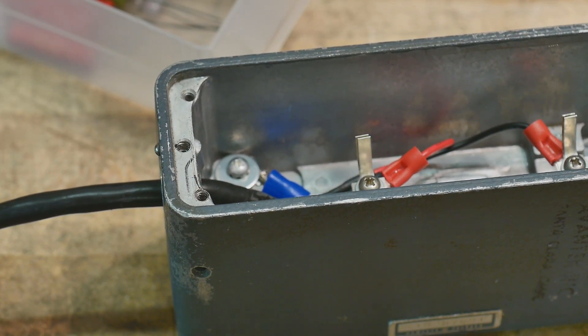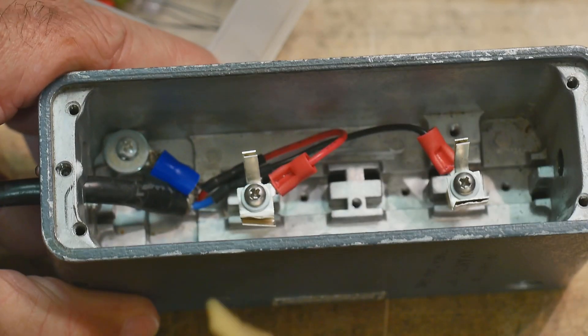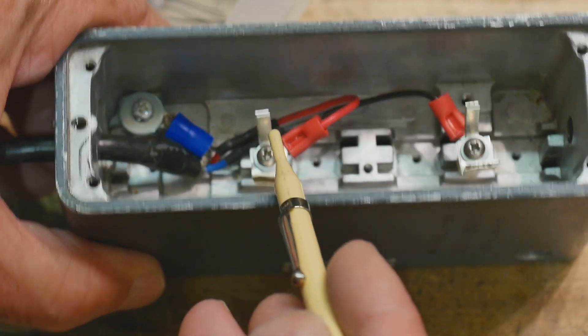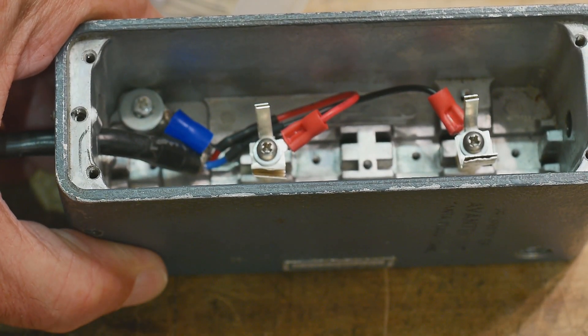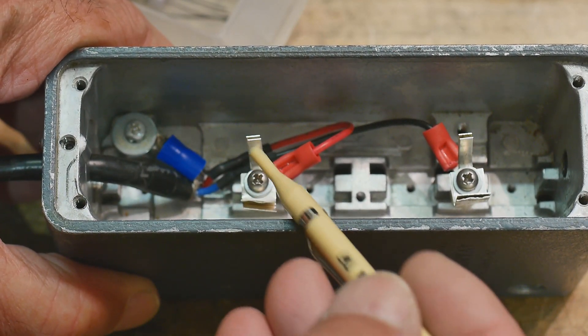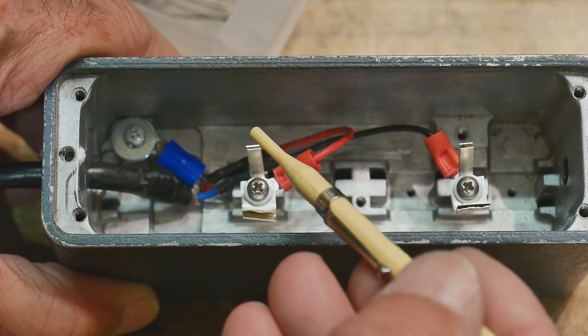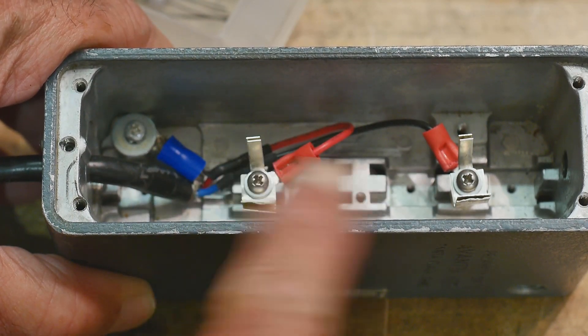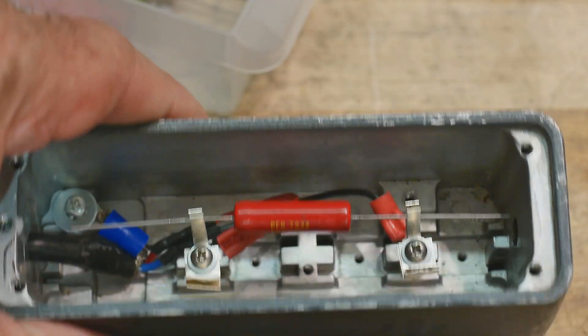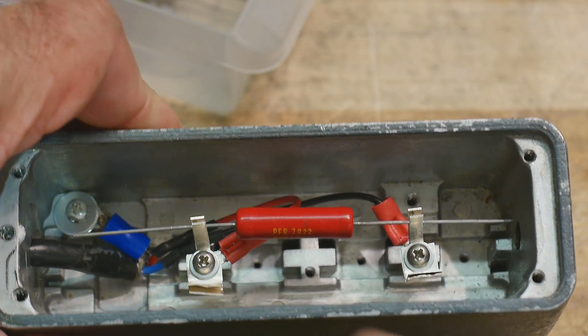That cable hooks up to the electrometer and comes in here. These are both on nylon standoffs, so they're insulated from the box. These little silver clips here are actually silver metal — leftover parts from when I ripped apart the attenuator, there was some silver shielding. I've used some of that and created a little V shape. I have two pieces of metal on each one, so if I bring something in to test, I can set it in this V and it automatically clips on, giving me a silver contact inside a shielded box.